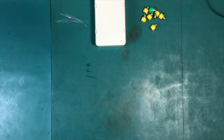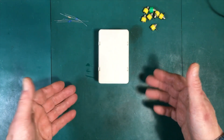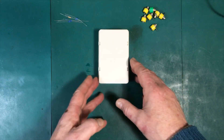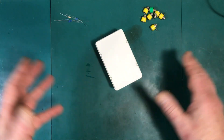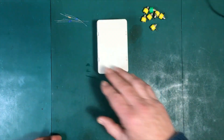Welcome back folks. Today we have a very simple little DIY project which I think is going to come in very handy, especially for me, and it might for a bunch of other people too. What I want to do is build some quick little calibration boxes — little boxes that have some resistors, capacitors, or diodes built in. The diodes you don't really have to calibrate because their forward voltage depends on a lot of things and changes depending on the current, but as far as resistors and capacitors are concerned,